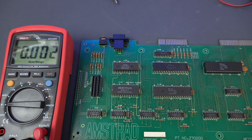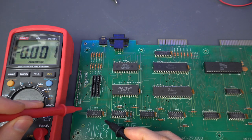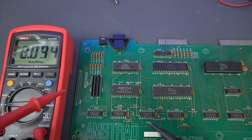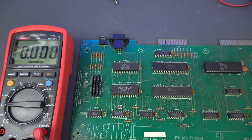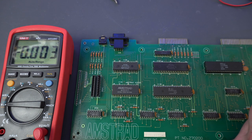If we're going to be methodical about this, the next thing I'll check are voltages. After seeing the current draw, I can tell they're going to be fine, but let's check just in case. I'm picking a place far away from the power connector and… 4.6V. Now that's rather low, but in my experience it's normal for this computer. There's no voltage regulator, so a certain amount of voltage drop is normal, and also there's something weird about my bench power supply that makes it drop a bit more than normal. But anyway, this should be totally fine.